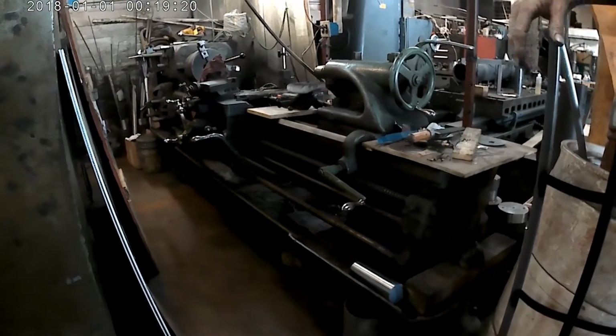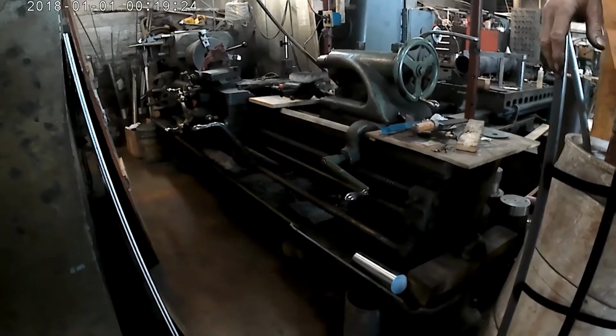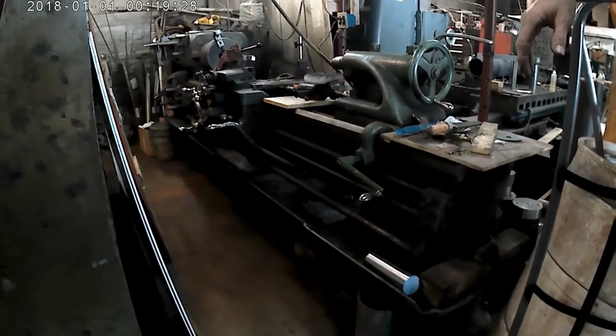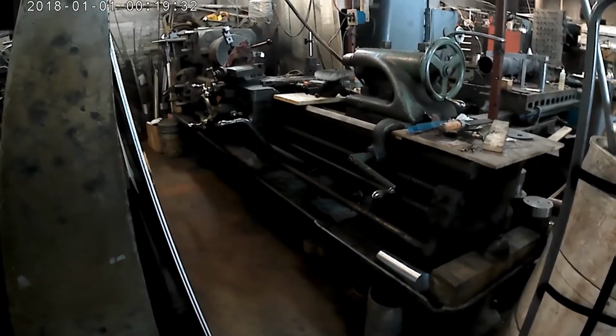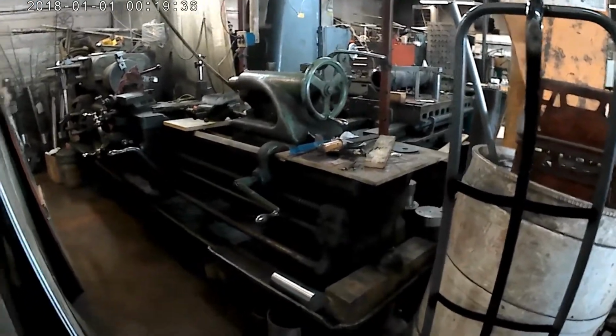So all you had to do is adjust the tension on the bearings. Yeah, preload. You know, tighten up the spindle and put the preload on the bearings. And it's great. And my best deal I've ever got is this boring mill. It's a small one, of course.